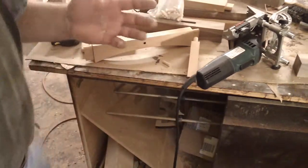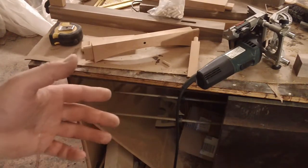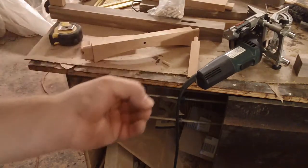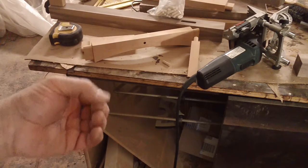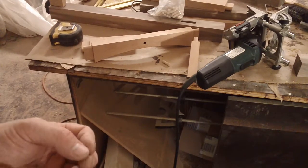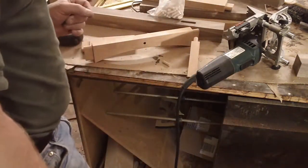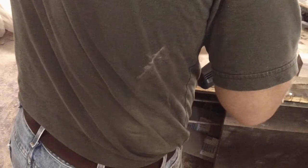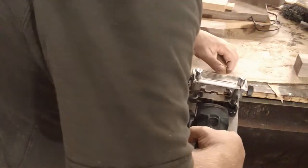And for some reason, and it's probably because, like I was describing with the glue on the tenon, you need to drill these in a little bit extra, more than what you think you're going to need. Otherwise, it acts like a hydraulic piston, and you'll bottom out the dowel into the glue, but it won't actually be seated clear into the wood. So, if I know I need at least 20, I better go a little bit more. I'm going to go like 23. Just to make sure.